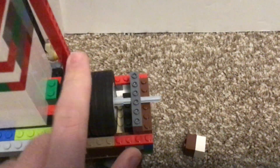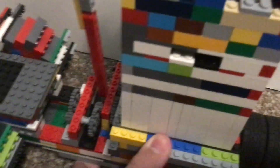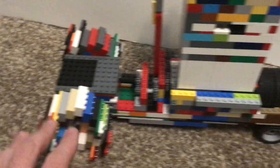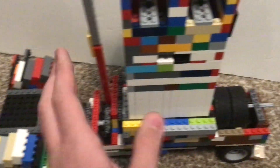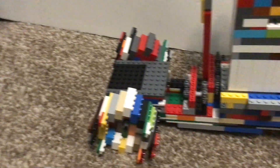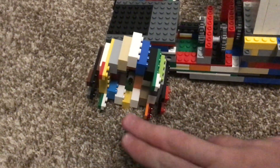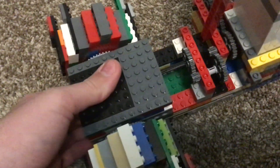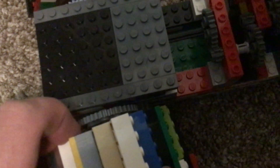I have two medium-sized flywheels — you can use two medium-sized flywheels if you want, but they'd really require the directed tires, which I was planning to use for the back wheels. One reason this didn't turn out looking like a great tractor is the wheel size — normally a tractor has huge wheels compared to a big engine. But I used this size because bigger wheels would cause the axle to bend more and potentially break.